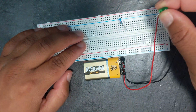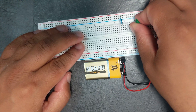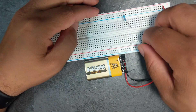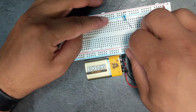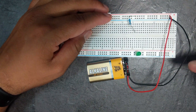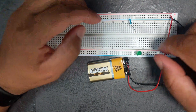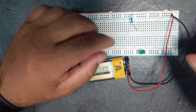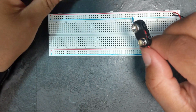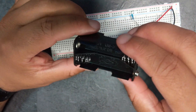If I plug the LED in somewhere else, nothing happens. If I plug it in over here — positive to negative again — nothing happens. Why? Because these two rails are powered, not those two. Okay, so I'll unplug this now — nine volt battery out.